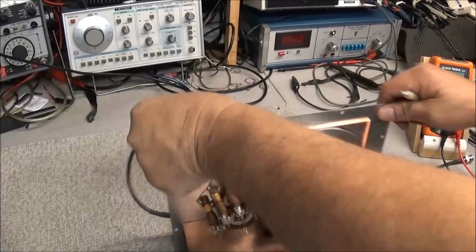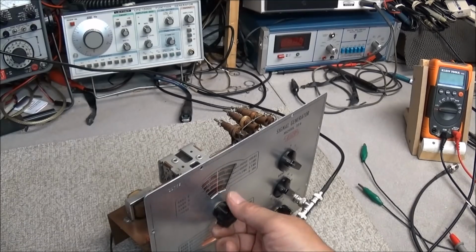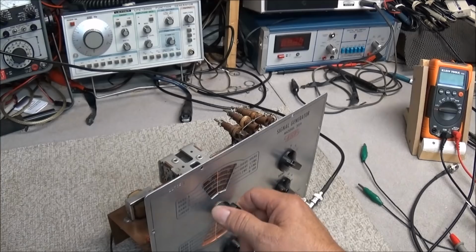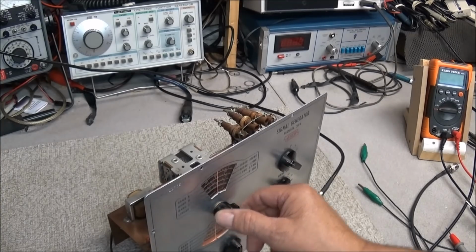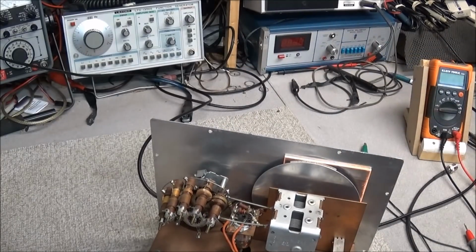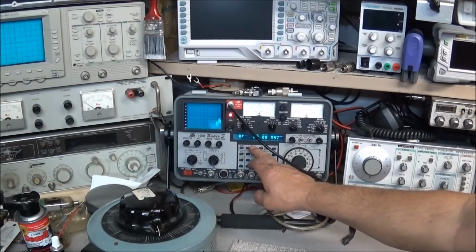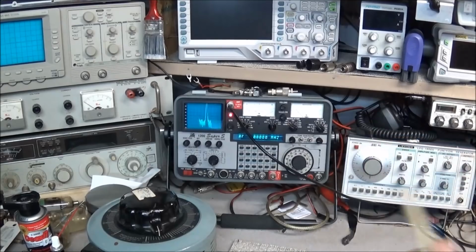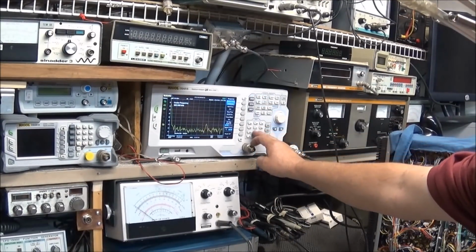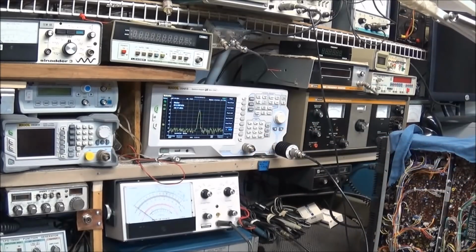Okay, now what we need to do is go to band B, and band B will be 400 kilohertz to 1.2 megahertz. So we're going to come here on about 800 kilohertz. Open the dial. We'll set the IFR for 800 kilohertz RF, and we'll put in 0.800. We'll go back to 10 kilohertz off. We'll go over to the spectrum analyzer on the Rigol. We'll put in frequency 800 kilohertz. And we'll peak that. And yes, she's off too.